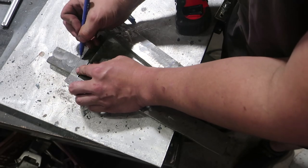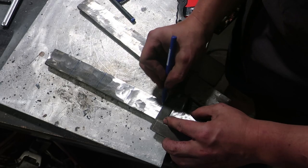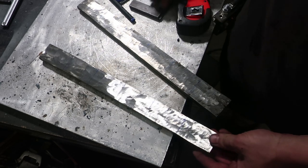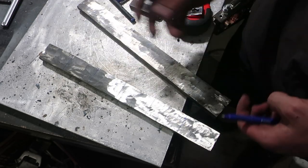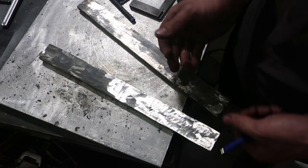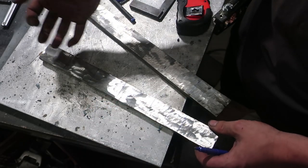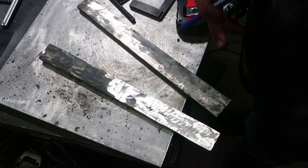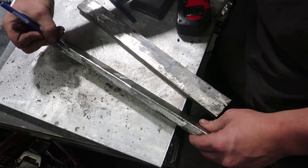This next bit is actually very important in terms of symmetry. You need to understand which order you cut this billet up in and keep track of it. The way this is sitting right now, you need to number it so you know exactly how it went before, because when you go to flip it over you need to make sure that each side is the side that you cut from. It's kind of like bookmatching a slab of wood — you need the end grain to match up with the same bit you cut off. Both sides need to match, and then you flip it accordingly.